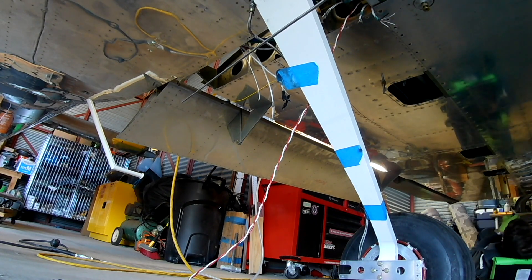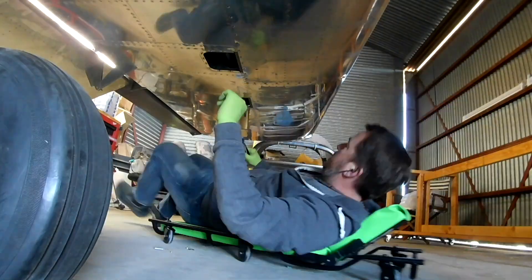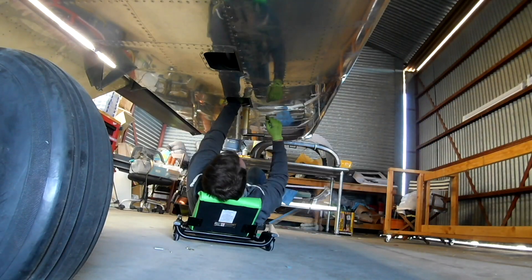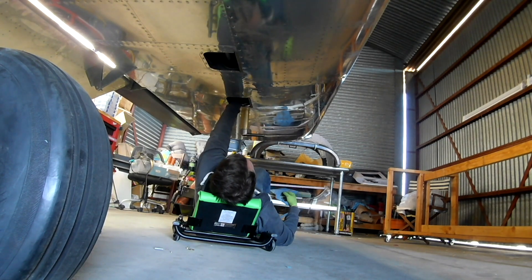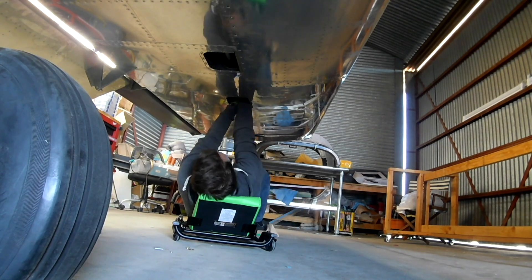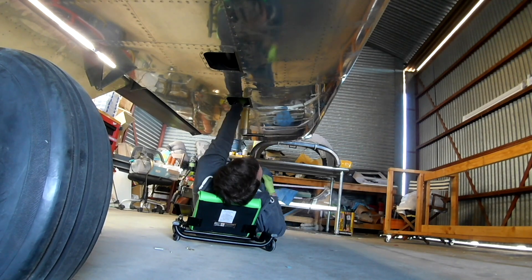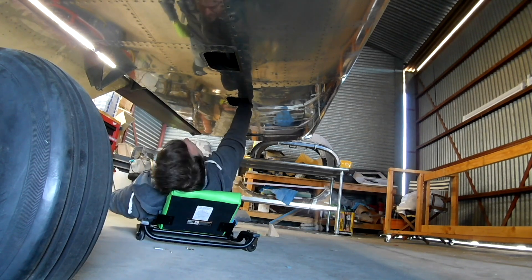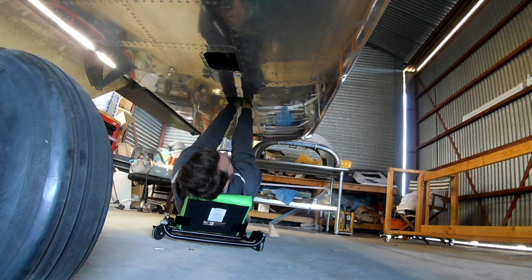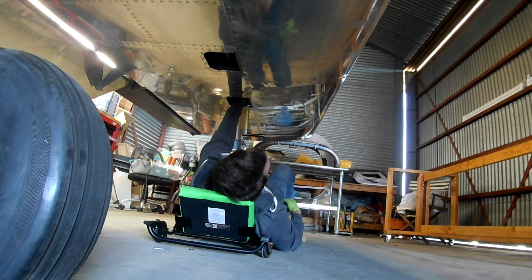It would have been nice if I'd dragged the camera over there so you can see what I'm doing. The big thing about the pitot mast — there, that's at least a little bit better. So we're connecting up the wires. We've already got the wires plumbed. Everything is good. It's two thick blade connectors, and this is a twisted pair — a twisted pair of 14-gauge wires. This is a lot of power, like 15 amps. It's a 20-amp breaker because it's 200 watts of heating power.